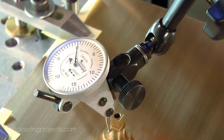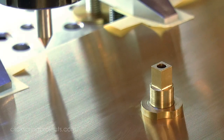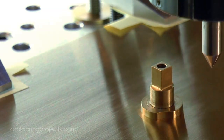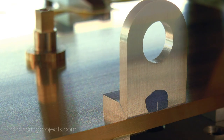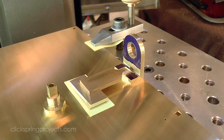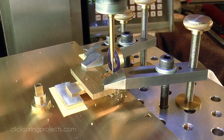The lateral position of the assembly was determined based on the main bearing position, and I put in two witness marks on either side of the main plate. Aside from being useful right now, they'll record the center line should I need it later in the build. With the input assembly position located, the bracket and underlying main plate were drilled out to accept a pair of steady pins.